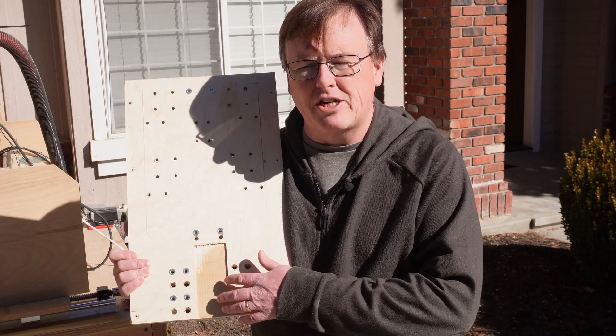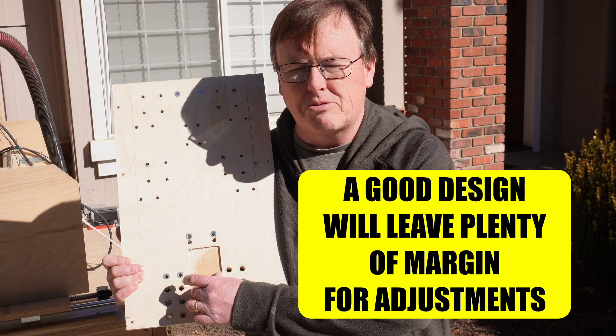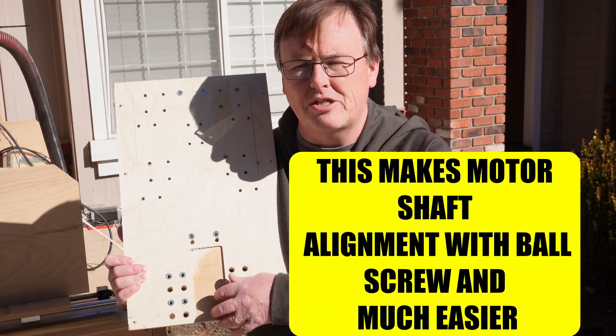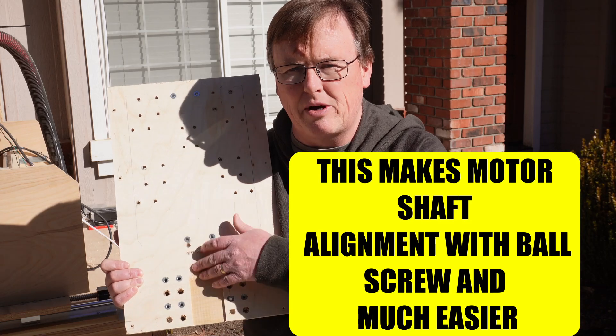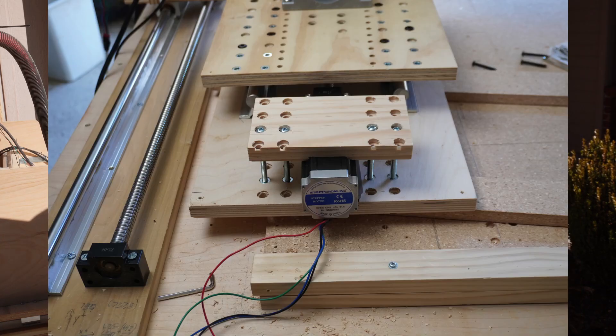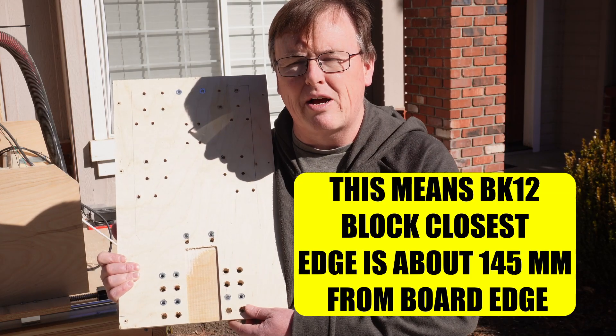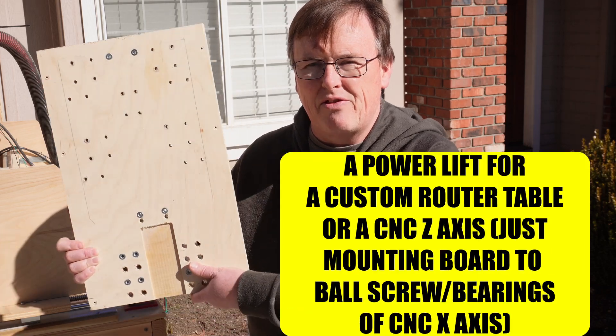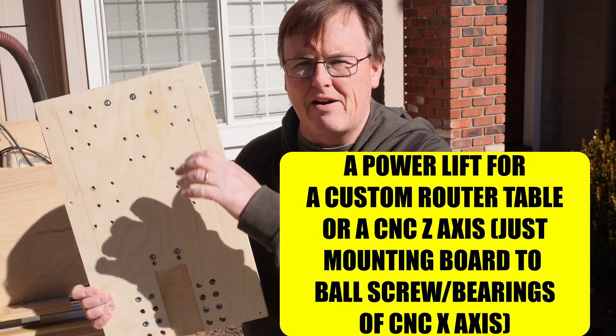It's really easy to over-engineer this. You want to put extra space in the pocket for the motor so it has leeway in both directions. If you're clever and it's a z-axis, position the motor so it slightly trails off the end — that way you can feed your wires out the back without cutting a hole in your board. When you're all done, this can be mounted and you'll have a router lift.